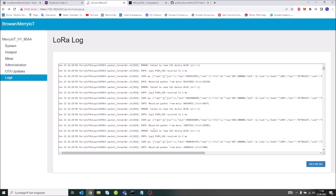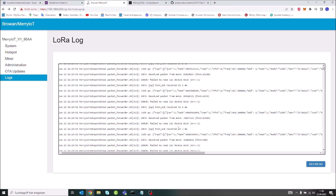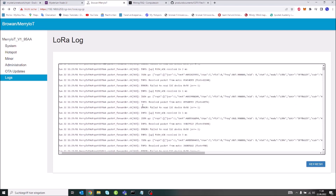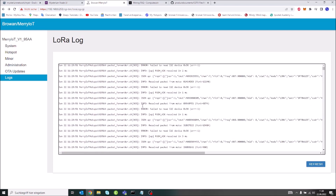At the moment we have some errors with the temperature sensor which is located at address 0x38, but this is nothing to worry about. I'm currently running an SX1303 concentrator by nfuse and just seeing how that goes.